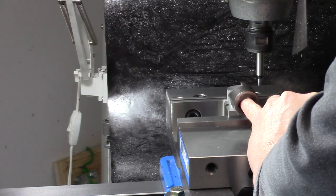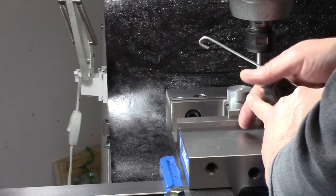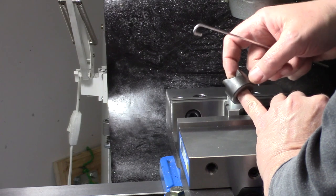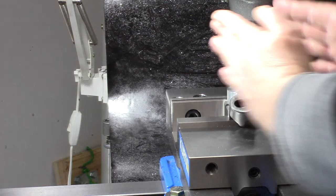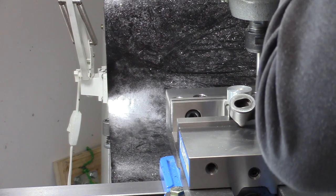And the driver is going to have a pin that it can go on the shaft, because this has got to go through a hole: the driver, the pin, the driver, this, and then a pilot will screw on the other end of it to hold it all together so that I can use it. This is going to be used to increase the width inside the frame on the motorcycle project.